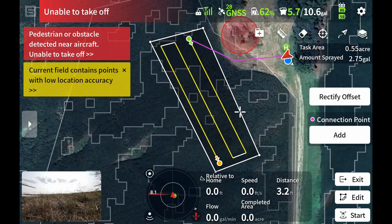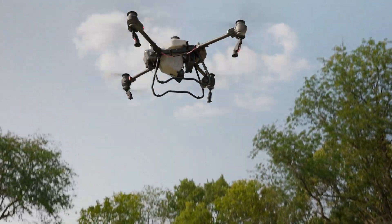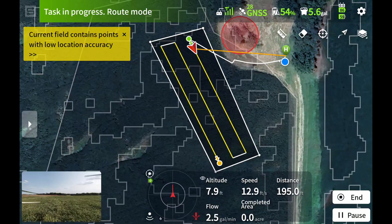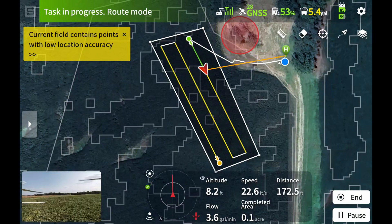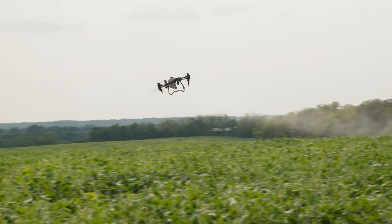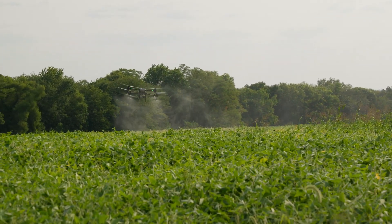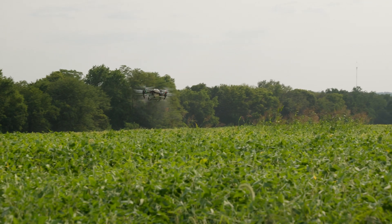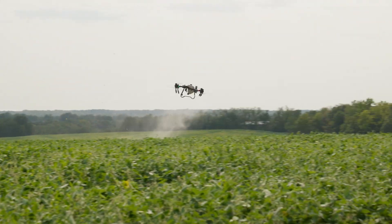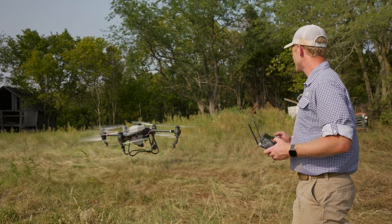So we're going to go ahead and back up, take off, and get to work. We're going to lower down right now and watch this drone as it goes by — we're going to achieve almost full speed because all four nozzles are spraying. This is going to create better downforce with the front nozzle spraying, higher speed, and our droplet consistency is actually going to be better because we're not forcing all of that 6.3 gallon per minute through just two nozzles. It's going to go through all four nozzles, so we have a lot less droplet shear and we create a lot fewer fine droplets utilizing these four nozzles.